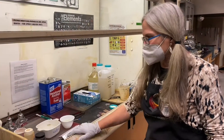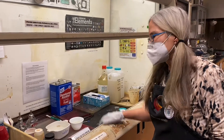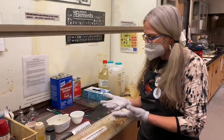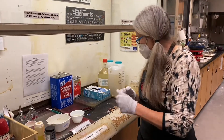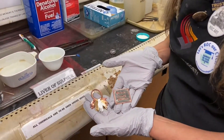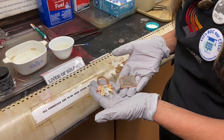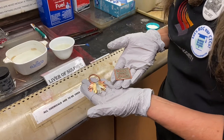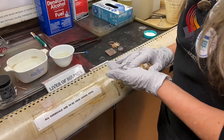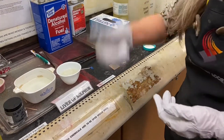We're over here by the chem hood where we try to do all the patina work, because some of the patinas are toxic — not in the sense that you're going to die tomorrow, but you don't want the buildup. I've got rubber gloves on because I have greasy hands. I've just cleaned these pieces with soap and water and a little bit of Simply Green, because if I get any oils from my hands on this, that'll work as a resist and it won't patina. So cleaning your pieces really well is important, and wearing rubber gloves means I won't leave a fingerprint on my piece.